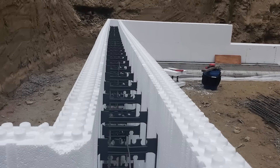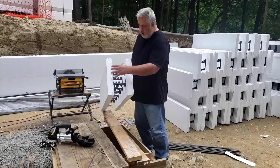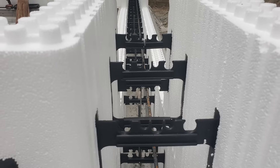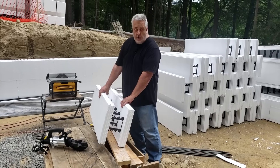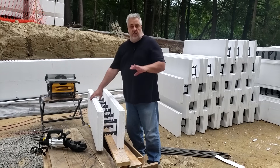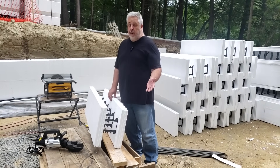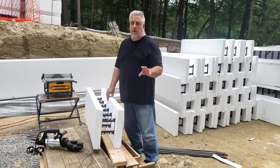I have one of them right here. What an insulated concrete form is, basically it's two pieces of rigid insulation with a spacer in between, and then they get filled with concrete. There are a couple of immediate benefits to using ICF forms. One, the insulation serves as your form work, and then it stays in and becomes the insulation for your wall system. A typical foundation here in New England would pour a 10-inch wall — here we're pouring a six-and-a-quarter-inch wall, so that core is diminished. We're basically taking about 40% of the concrete out of the foundation system without really jeopardizing its integrity.